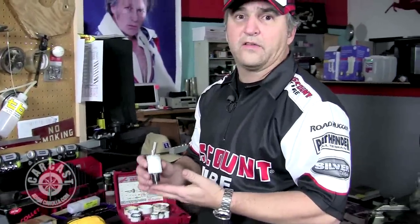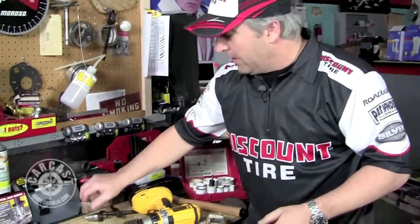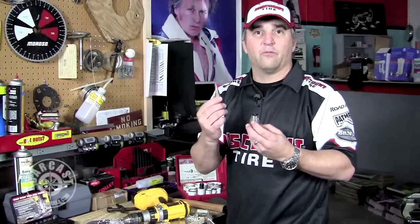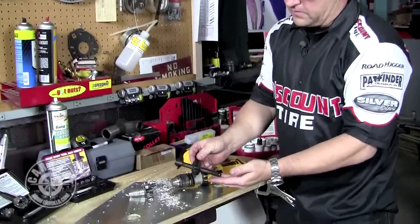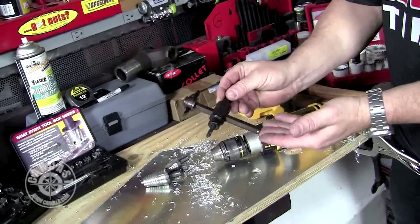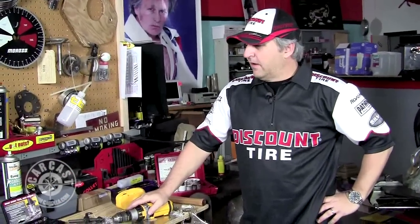You can't go wrong with a hole saw if you don't have one in your toolbox — get a kit from Milwaukee or one of the other bi-metal blades that are good. Don't buy the cheap ones because the blades will self-destruct. The unibits are another great addition to your toolbox. The big one is somewhat expensive but the small ones are probably under 20 bucks, and this will save you so many times from having to find a missing drill bit size — they almost never break. The large adjustable hole cutter can cut up to eight inches in diameter. Really difficult to do handheld, but for drill pressing, it's something almost from the woodworking world that will cut metal and do a great job if you take your time. Hope you enjoyed another CarCast Tech Tool tip segment — drilling, boring, and you.